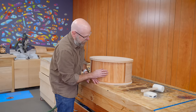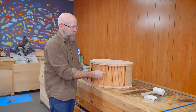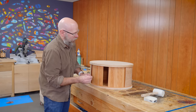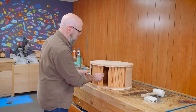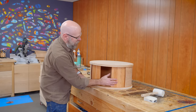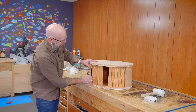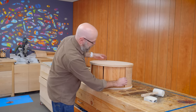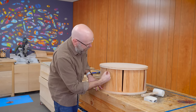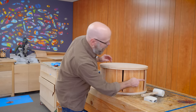What I totally forgot to do was make handles for this before putting the wax on. I can either sand the wax off or add a physical metal handle on there — but we got past the hardest parts. There's a little bit of bowing on the ends here. I think if I cut a piece of oak, cut a dado in there, and slap it on the edges, that will straighten it up and cover up the plywood edge.